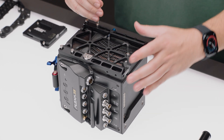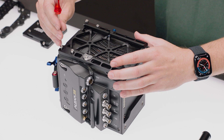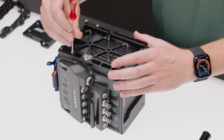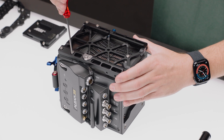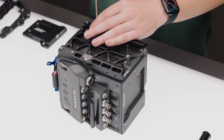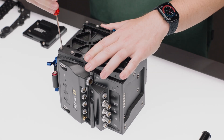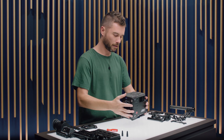There are four screws at the front and one screw at the back. When you're putting it on, just get all the threads started first. Make sure the screws are all aligned and in their holes and then give it a bit of a nip up. You don't really have to crank down on these screws — they just need to be firmly finger tight and they will stay there. Now we can turn the whole thing the right way up.